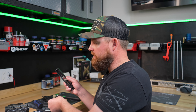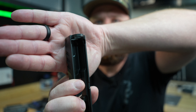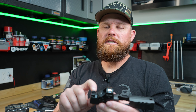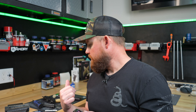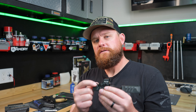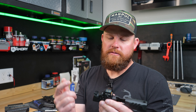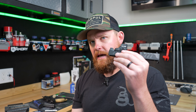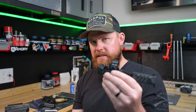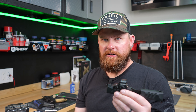These are a similar install as the Glock sights. There's a small screw, just like the Glock sights, to replace that front sight. Then we're going to use a drift to drift out the rear sight. I do have a sight pusher I could use for the rear sight, but I'm not going to use it on this one because I'd have to take the red dot off and I don't want to go through that hassle and re-zeroing it and all that.